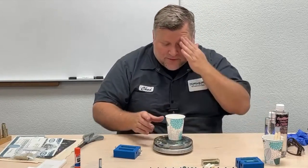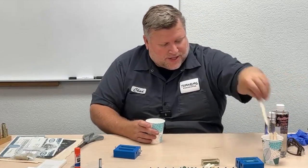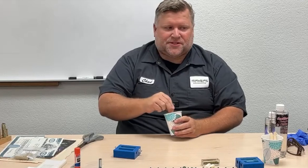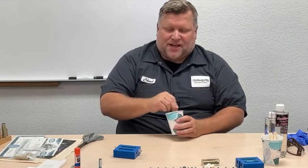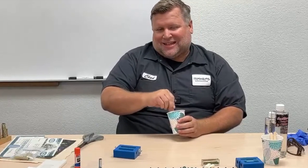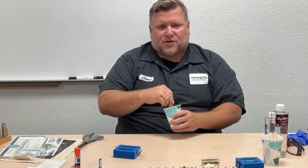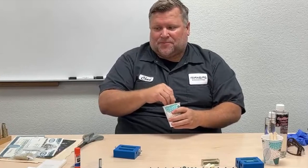Okay, so I'm just using a paper cup, and I'm going to use a stir stick. Now, with epoxies, you want to stir really, really thoroughly. I always say with liquid diamonds, stir at least 3 to 5 minutes, and that is because it's a thermo-cure, meaning the 2 parts have to mix and start to heat, and that's what sets the resin. So sometimes with resins like this, you can't pour like 1/4 of an ounce, because it won't build up enough heat to cure.